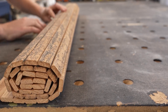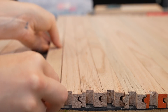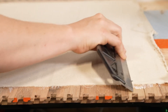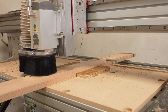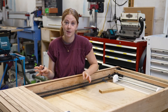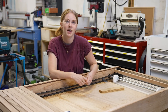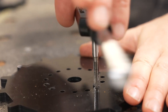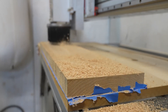For the rolltop surface, she's making a material called tambour. It's made of a large number of interlocking slats of wood that are held together by fabric that's been glued onto the back. For the rest of the structure, she's making heavy use of her CNC router. The tabs on the tambour slats slot into grooves on the table sides. The sprockets that feed the slats are also cut out on the router, and even the legs that interlocked gorgeously into the frame were cut there as well.